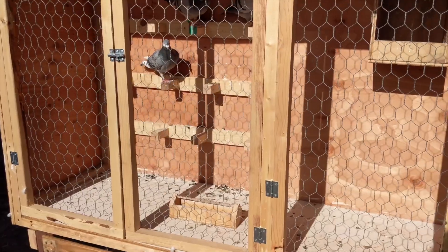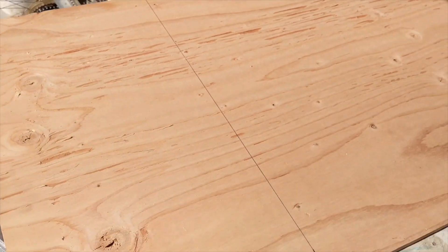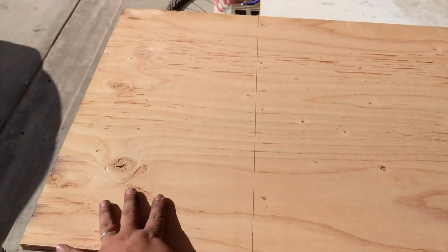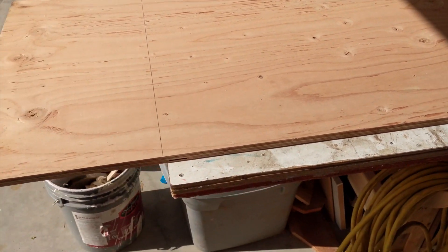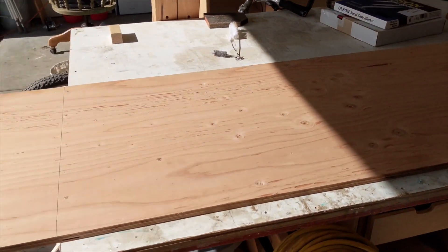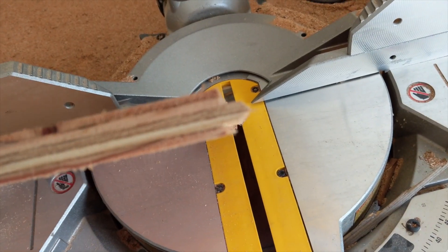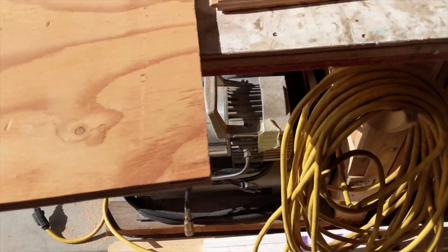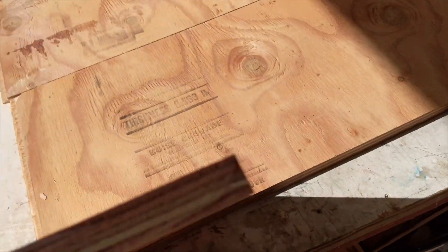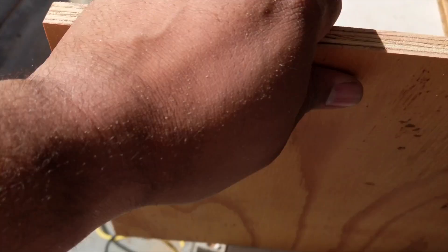Birds are digging it. I'll just let you know on the progress. So I got this piece here — this is 24 inches wide. I'm going to go 12 inches deep. I'll need five pieces to make two boxes, so I only have enough for two for now. I'm using this plywood for my framing and it has this notch, so I'm chopping it off so that I have two flat sides. Otherwise it's going to be all jacked.